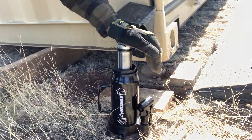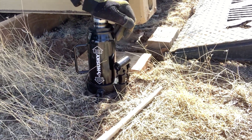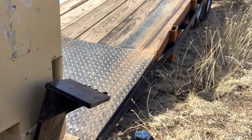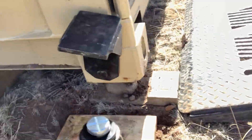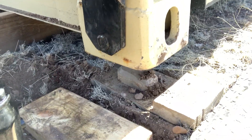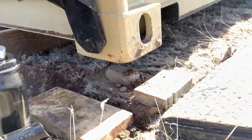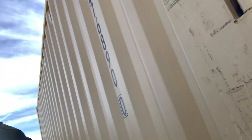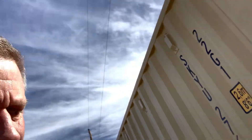A bottle jack you can get from Home Depot or Harbor Freight — no real questions there. But this particular product you could weld your own, which is totally possible. I'll show a picture of where I got mine so you can grab one yourself. So if I turn this sideways it comes out — you see the size of the hole: you go in, turn this way, and it's a very simple locking system. Semi-trucks have something similar — a cone shape that clips and turns to lock containers on their trucks, considered safe enough to go down the freeway.